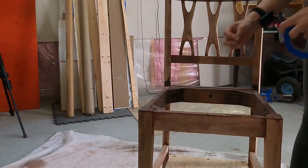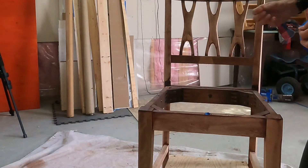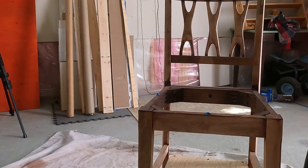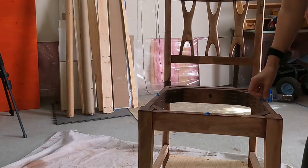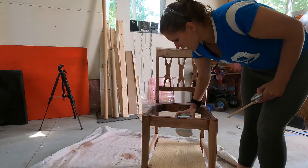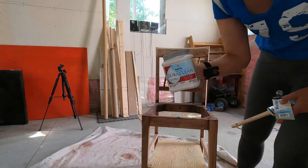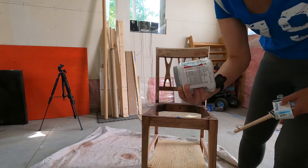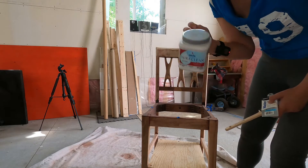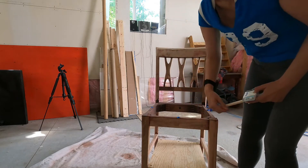Just to protect myself I'm going to cover the tips of these screws with a little painter's tape just to make sure that I stay aware that there are sharp bits about. Today I'm going to be using a two-inch angle brush and then I'm gonna go with the Dutch Boy DuraClean, just white base A. This looks like it's a paint and a primer so I just had to buy one, and it's flat because I don't like my furniture to be shiny.